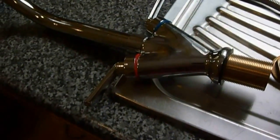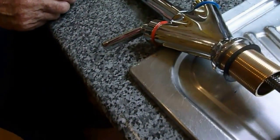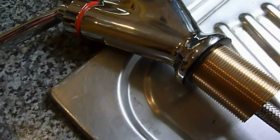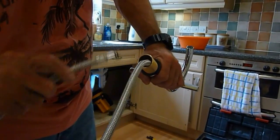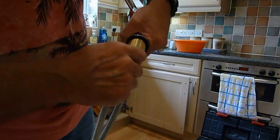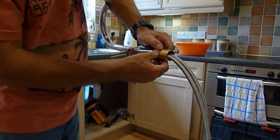Here we have the new taps. The first thing we've got to do is screw these unions up into the holes inside the taps - you'll see there's a couple of holes in the taps and we just thread these up. You don't have to do them too tight; there are little spanner nuts on them. Also clean around the hole in the sink - it's going to be mucky and dirty before they go in. There's a rubber washer with these that goes underneath, make sure that's on, and there's one for underneath to lock it on. These unions only need to go up by hand - they've got a little rubber washer that does the seal, no need to overtighten.